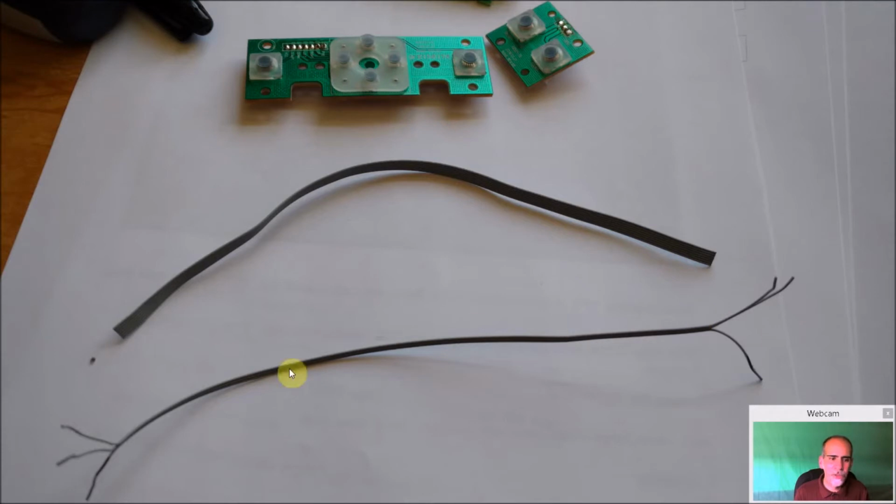Now these wires, I made 2. I made one here for the main control panel and one for the secondary control panel. And again, I made them too long. They're about 10 inches. But at the time I was prototyping, seeing how I wanted it to flow in the unit. But you could probably get away with just 5 inches, half that length, on both of these. And again, it's just an old IDE cable.